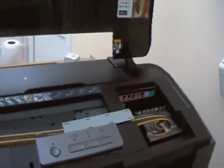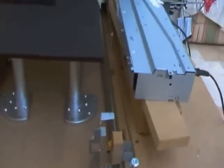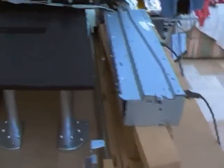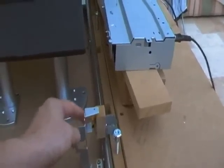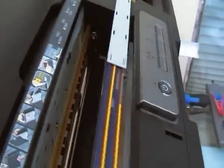I've got a continuous ink system that I've put in. The inks are here — I've covered it fully because you're not meant to subject it to direct light. The PE sensor is probably not the best place to put it, but I put it there because it was easy to access and I could move it later. The basic idea is that you pull the drawer back and this here will go in between the sensor, and then this top platter will be where it needs to be.